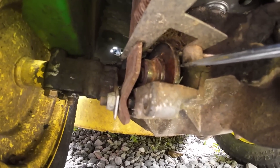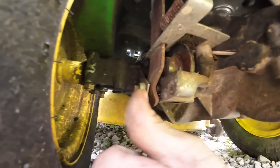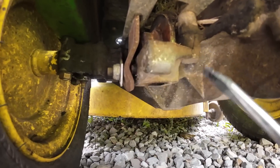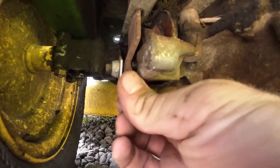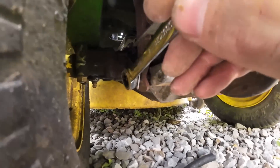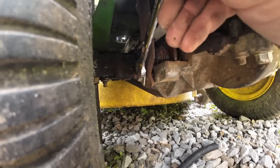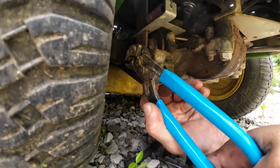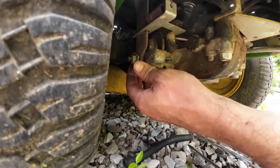Here's the brakes on the GX75 — see that little disc right there? That linkage is attached to the pedal, and when you push the pedal, it pulls it forward and engages some kind of mechanism. I don't think it should have that much play, so we're going to tighten it until the play comes out of it and see if that gives me brakes. Somebody in the comments will be able to explain how it actually works if you're curious. I'm just doing a good old educated guess here — I'm just going to tighten that down until the slack is out of it. There's no play — there's a lot less anyway.